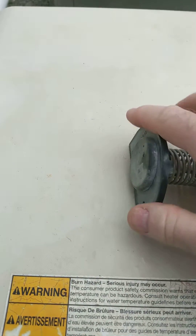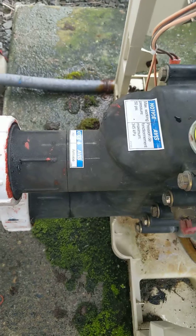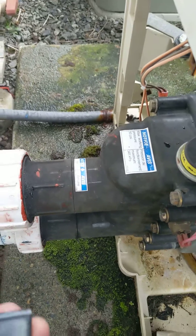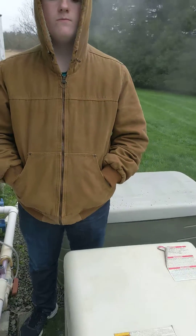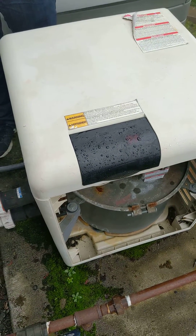There's one other common problem for these besides those two, and that's the bypass valve right here. It allows water pressure to open and mix a certain amount of hot water with the cold water coming in, so that scalding water isn't coming out. Sometimes this piece will break off or jam, and that'll be the problem. That is essentially a 101 on what might be wrong with your Pentair Master Temp 400 heater.